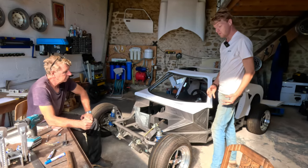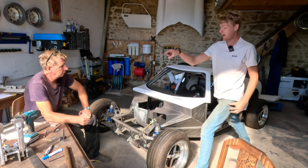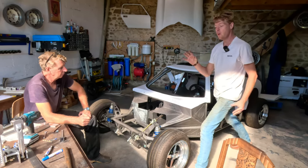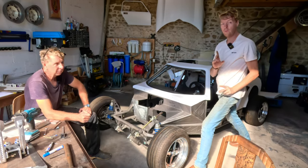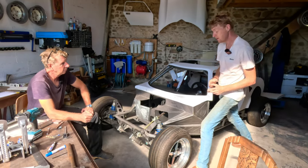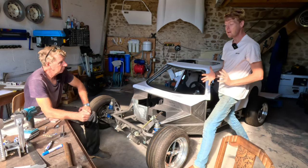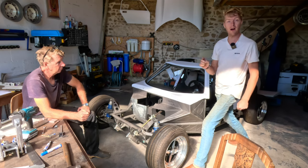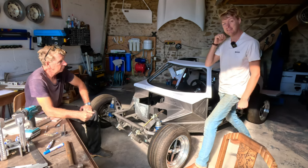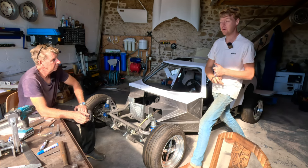So what we've got to do is let the air out that gets trapped around our tyre and let our cooling air out, which will not only prevent lift, but we want to cause suction. We actually want the area here to be so big that it sucks air from the front of the car, sucking the car forward, exactly the same as the Spitfire and Mosquito aeroplanes.